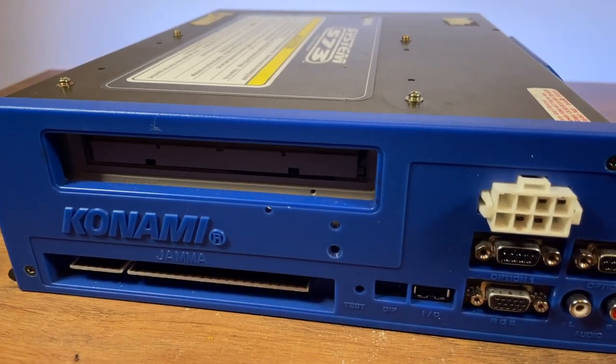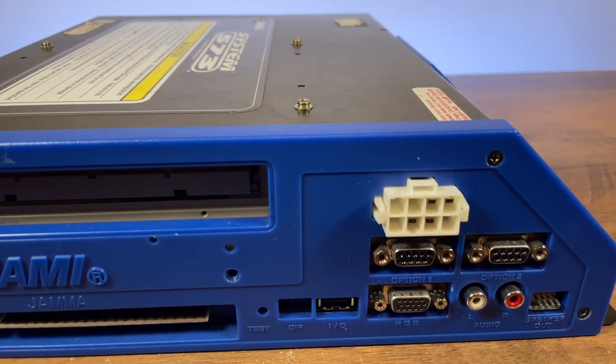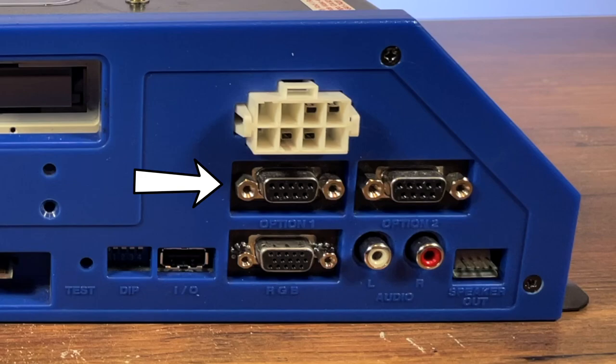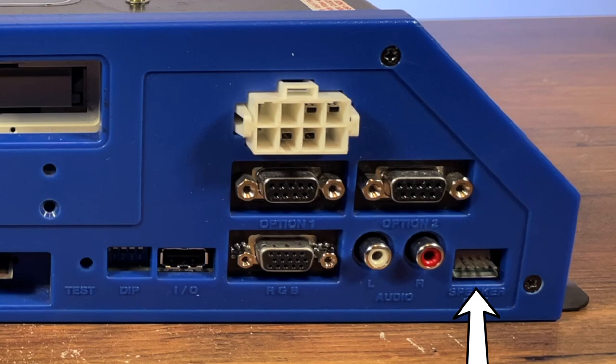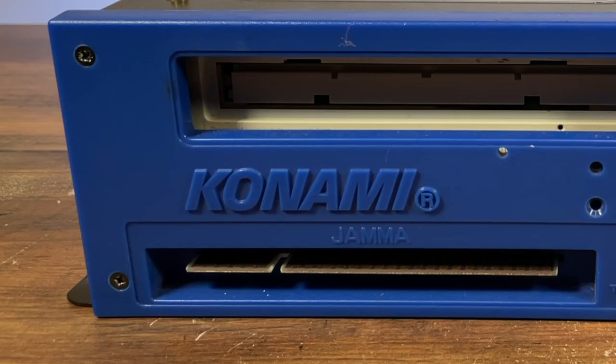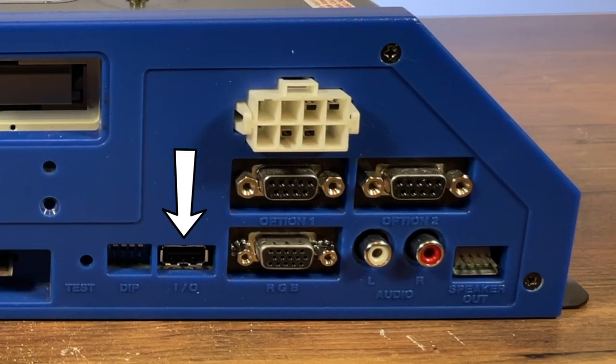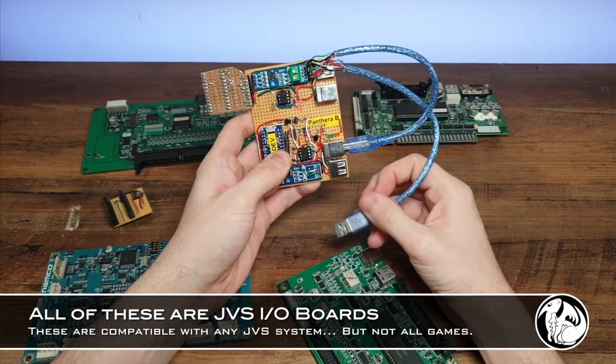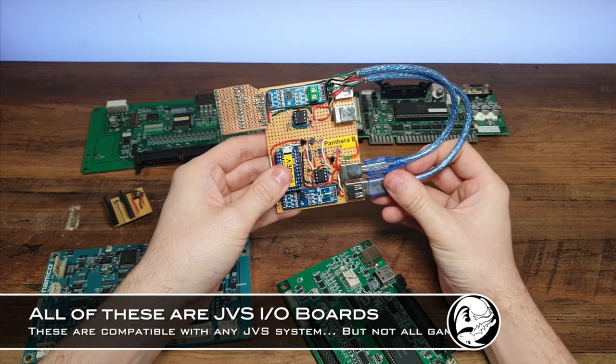The 573 is a very versatile system, designed with a built-in JAMMA connector and having JVS connectors on the right-hand side, as well as two extended IO ports above them. Whilst looking like DE9 serial ports, one is actually for connecting player 1 and player 2 kick harnesses, whilst the other is connected to a quad-channel analogue-to-digital converter for potential use on games like drivers. Audio comes in the form of line-level RCA jacks, an amplified stereo speaker output, and mono audio from the JAMMA port. This JVS-IO port uses RS-485 for a multi-drop IO bus with auto ID assignment, replacing JAMMA in arcade cabinets and allowing for more flexibility in controller input and output.